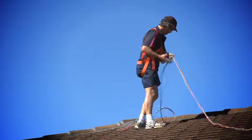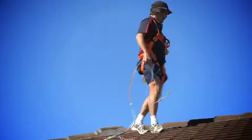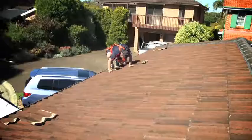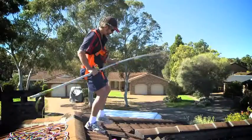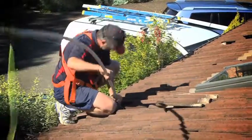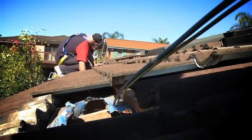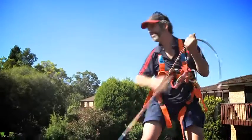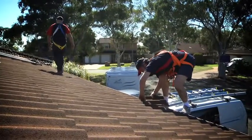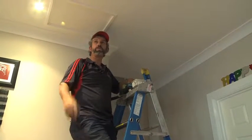What I've got here are my two DC cables — the positive and the negative — plus an earth cable that we bring up as well. What I'm doing at the moment is starting to run these in the roof. I've got a spot down along the side near the gutter in the eaves, so I can use my conduit to slip along and run the cable through that part. Once I get to the corner down the bottom, I'll have to get inside the customer's house through their manhole and run the rest of the cable around to our exit point underneath the panel.